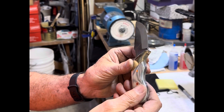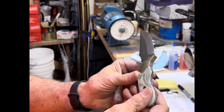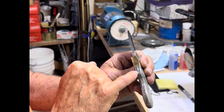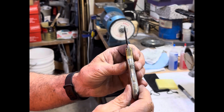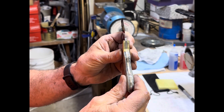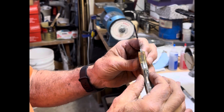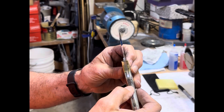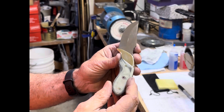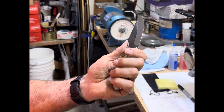I was not able to get the scratch out of the blade because I'd have to rework the whole blade and I just didn't want to take the chance. The one thing that did not improve was the gap between the steel and the handle material — that was because of a bad glue up. I just did not adequately clamp the two handle grips onto the steel when I glued it up, so there's a gap in there. It's filled in now pretty much with resin and grinding dust, but it never really improved much.